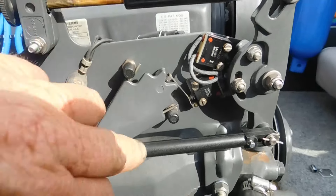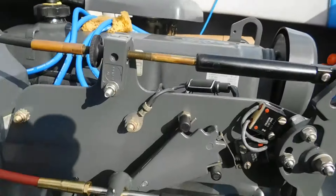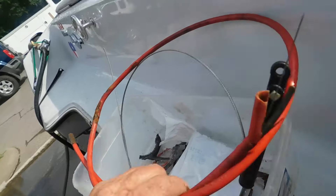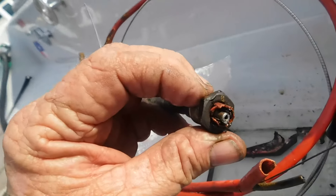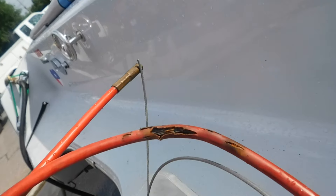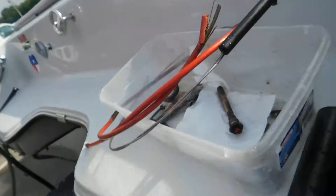As you can see, it now works. When you want to try to pull it out of gear, and with the stutter switch not working, and this cable being the original cable that came with the boat, the housing had just deteriorated, the cable had come apart, and it was just rusty. I guess you need to replace it every 25 years.